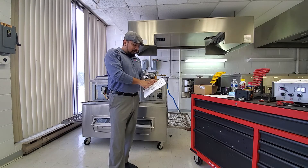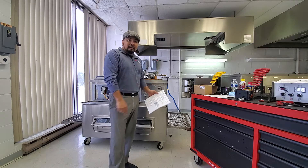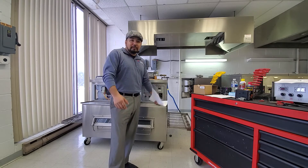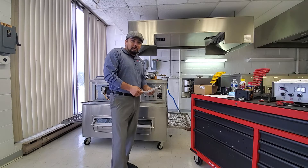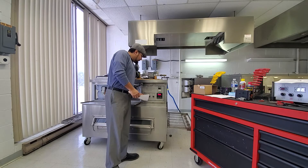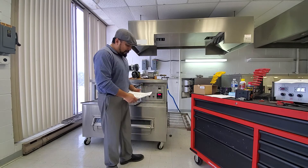The 570S — S stands for solenoid — and any of the PS200s, 200, 224, those are all going to have to be programmed. I'm just going to run through the instructions here on how to program that, and then we're going to set the set point, fire this oven up, and the installation is done. So the first thing we'll do is turn on the oven here. You see that we got power to it.